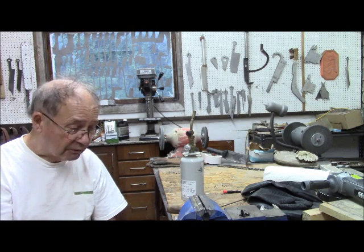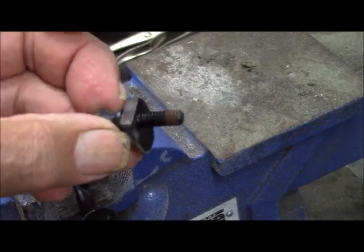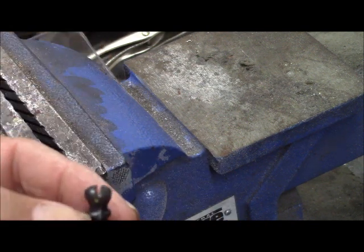I'll bring the camera up and give you some close-ups of the components. You can see, obviously, this thick layer of rust in the threads — that was what was doing the evil. And you can see the slot I cut. We cut it through the transverse hole, but that's all right — some of the originals were actually cut this deep as well, and this one should have been really. And this is the top jaw — this part is where the rust was very heavy indeed. We used a solvent to get some of that off, and we're going to brush and scrape a little bit there.